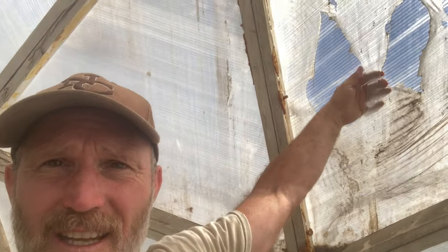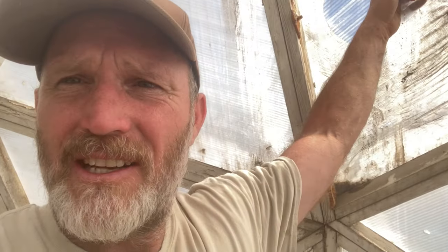Regardless, it still works just fine for growing. But look at the heat — the polyiso insulation I had in here kept the heat from transferring. The sunlight would come through the polycarbonate, get trapped with that insulation, and it got so hot that it just melted away the polyethylene.